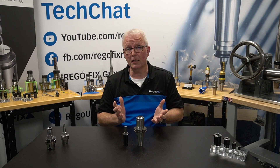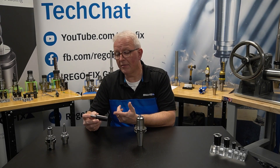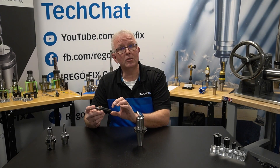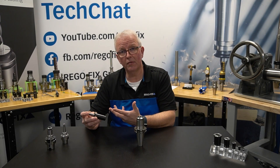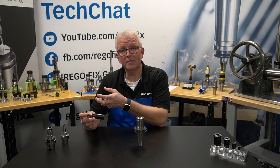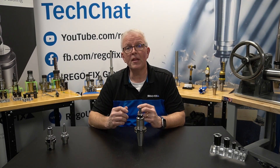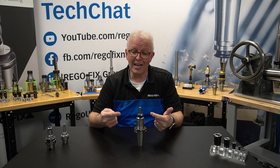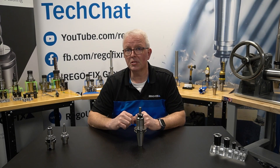What about the collet? The collet itself is rather unique. It has that same 1-to-100 taper on it, but it has a black finish to it. What is this black finish? The black surface treatment is an impregnation process done during the hardening cycle of the collet. It creates a very, very hard surface with just a slight amount of lubricity. That little bit of lubricity allows us to press the tool in and pull it back out without the material galling or without that collet becoming one with the tool holder. The lubricity is very, very important to how the Power Grip system works.